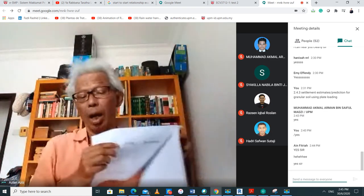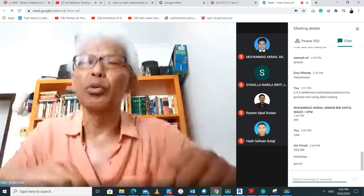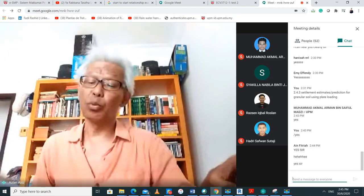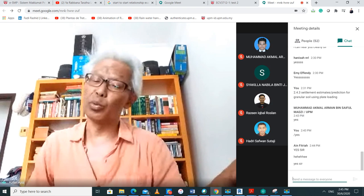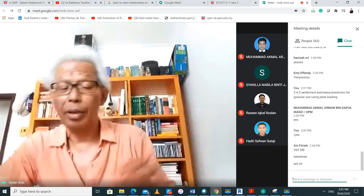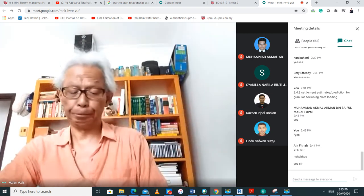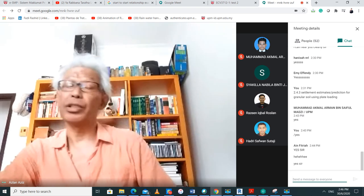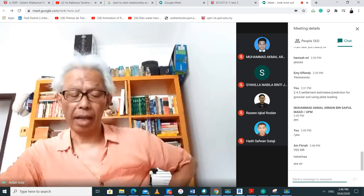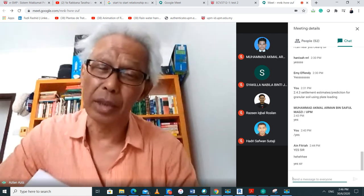So I just want to remind you again that this was pointed out to you previously in site investigation. This was repeated to you when I read this set of notes a few minutes ago on page 21, right? Just before the equation, I said to you homogeneous sand or soil and thick stratum or layer, then and only then can you use that equation.